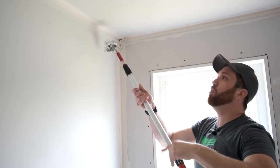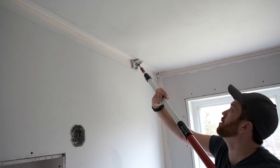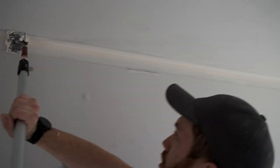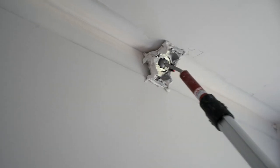You can see it leaves a really nice even fill — this is what you're looking for. You want to try to avoid areas where the mud didn't quite fill the edge of the bevel. If you're using a three-inch or three-and-a-half inch angle head there might not be enough excess mud to properly fill the edges of the tape. But we have a little bit of excess mud here, so you can see that tape is now nice and full.